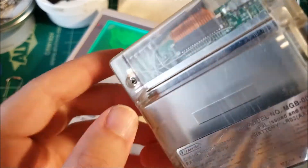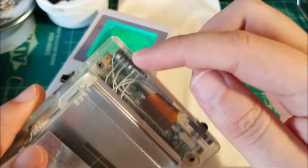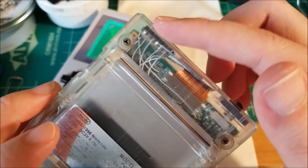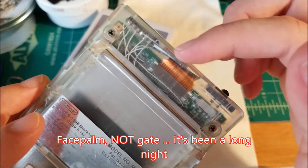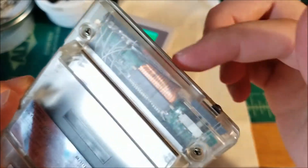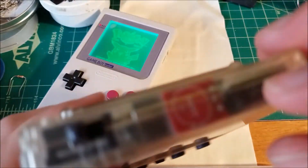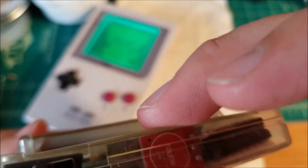Additionally, I moved my touch sensor and pretty much swapped the places. The bivert chip I used on this guy is an XOR chip — the old one was just a regular NAND. I moved the chip next to the ribbon cable, and it kind of bends the cable over a little bit and sits at the top. The touch sensor I moved all the way into the corner here, and I shaved it down much more. You can see it's a little bit of a tight fit, with a gap around the top.